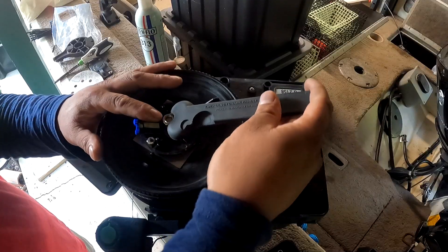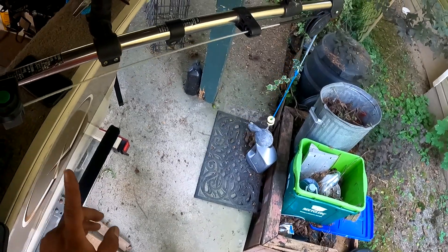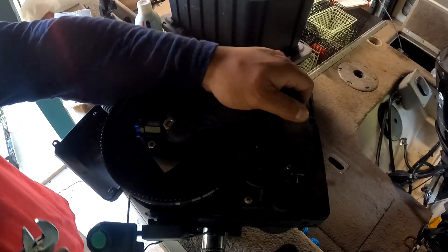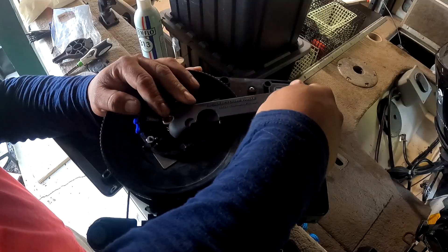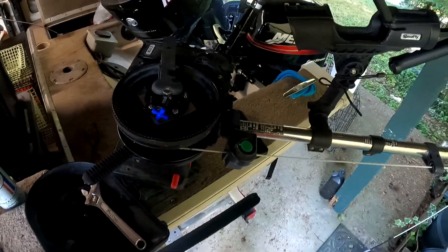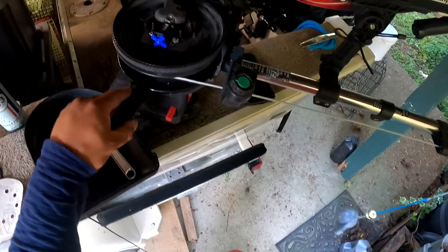Put our emergency handle back in and test the unit again. There you go — as you can see it is holding the weight. Now let's see how much pull it can handle. It's a little tight, so we're going to give it maybe an eighth of a turn — just like that. Now that you're familiar with this, you'll be able to do this on the fly in case you have currents you're battling on the ocean. You can just take off the cowling, remove the handle, and tighten or loosen that to your needs.